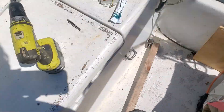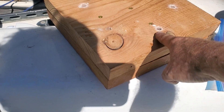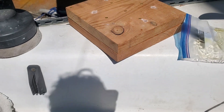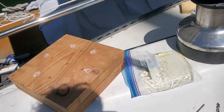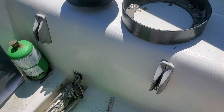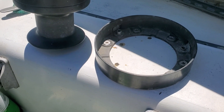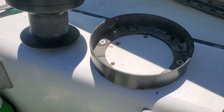I built this jig right here. It's got six holes drilled in it at the same pattern. It's two 2x12s screwed together and glued together, then drill-pressed to put those holes in it. That keeps this long bit from changing angles. The holes on these are a little bit off, so the jig was a little off.